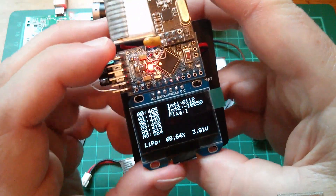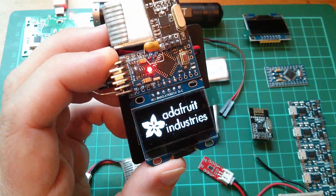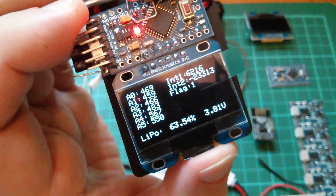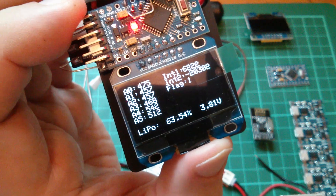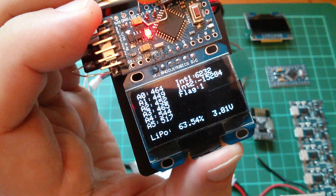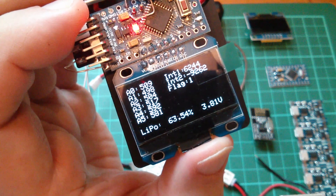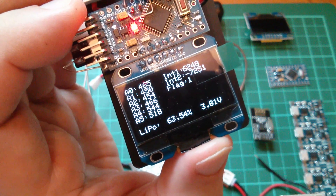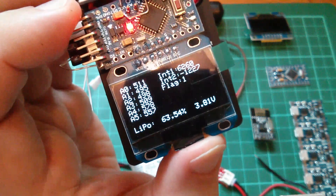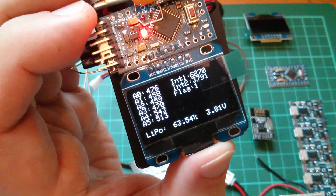The main thing I've done is switch to the Adafruit OLED display library, which has the advantage of making the code a bit simpler. I'm just using Adafruit library calls to display data in various positions on the OLED. I'll put a couple of comments on this video - one will be the receiver code using the new Adafruit OLED display library calls, and another will be the transmitter code.